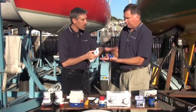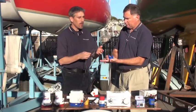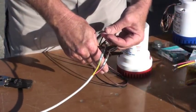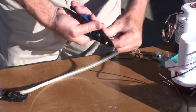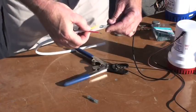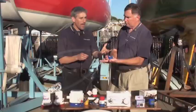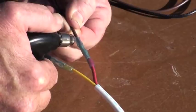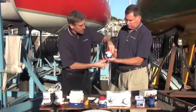In this scenario, you're using the same pump, keeping the base in place. Now imagine this is connected to the lead wire going to your circuit panel. You snip both sides of this, strip it, apply the heat shrink butt connector to both ends, crimp it, and heat it to compress the connection.